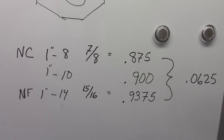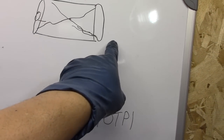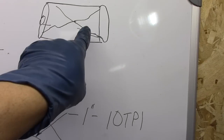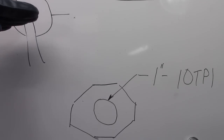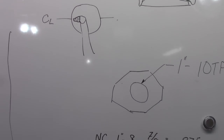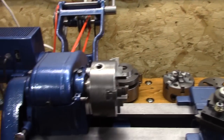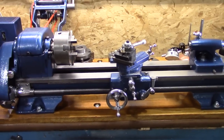I am so happy I was able to get the hole to work. What was going on before is when I'd run the boring bar into the hole, it would just rub. As it rubbed, the further it went the more flex in the tool, so it wasn't cutting — there was more resistance, and it was basically making a cone. A raggedy cone at that. But once I tilted it down on an angle and brought the tip up to the centerline, holy cow, did she start cutting. I'm finally cutting instead of rubbing the metal off, and that's extremely exciting. I see now that it's operator error — which it normally is — but at least I know how to fix it. If I can get the correct tool angles, this baby is a beautiful cutting lathe.